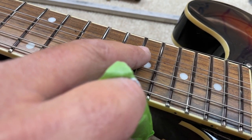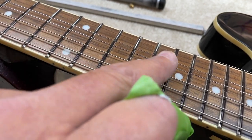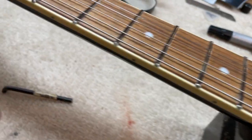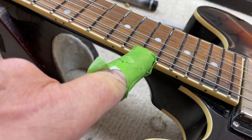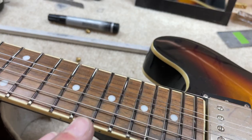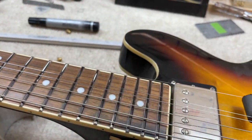So there's a low one between two high ones. Because they're all reasonably high, I can tell you that one's just low. And then there's five low ones in a row. So we've got cutting, not cutting, cutting, big chunk, one not cutting, one cutting, and then a low spot. So the dark bits where it's not touching at all are the pits in this little seabed drawing, right?